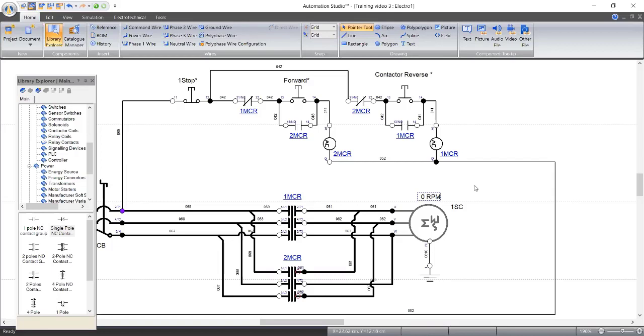when we're defining induction, we said when a metallic material, according to our physics textbook, when a conductor moves across a magnetic field, what will happen? An EMF is induced. So that means if I have a magnetic field and I keep striking a conductor inside it, then EMF will be induced.